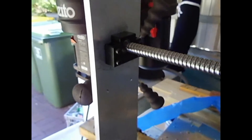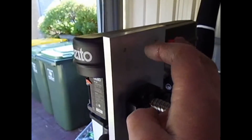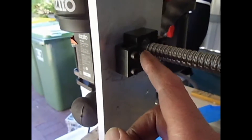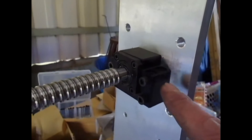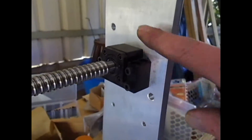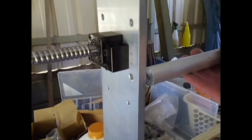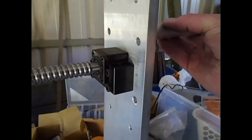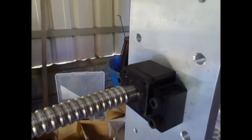Alright, so I've got all the holes drilled and tapped. The top two are for the linear shaft supports, the bottom two are bearing ends. The machining's a little bit tight there — I'll have to sand some of that off with emery paper. Same on the other end, the fixed end, there are four big holes for the motor which is going to sit out here. I've got some inch bar which I'm going to turn down to use as spacers for the motor — there'll be four of those. Same here with the bearings, it's a little bit tight.